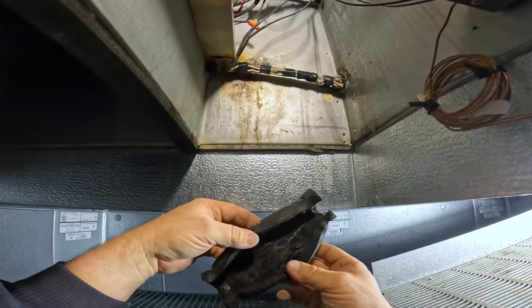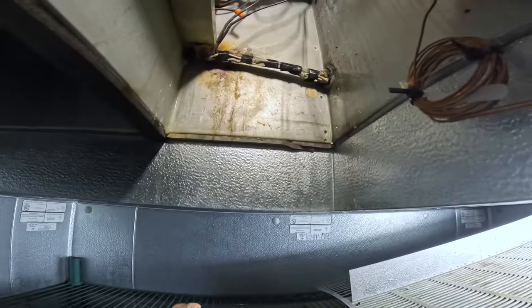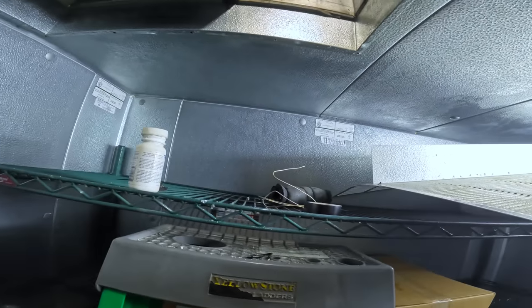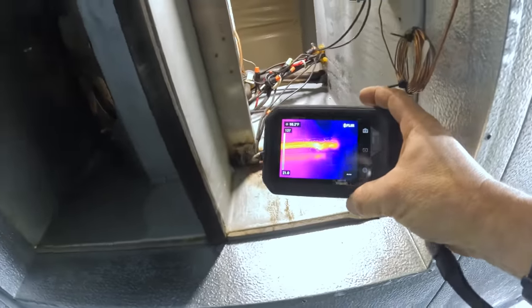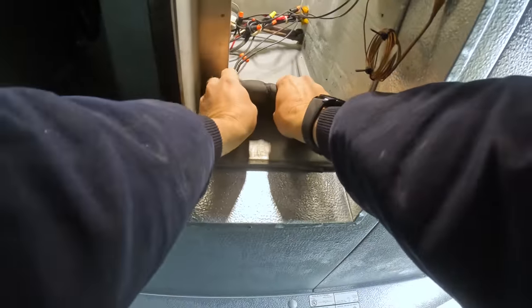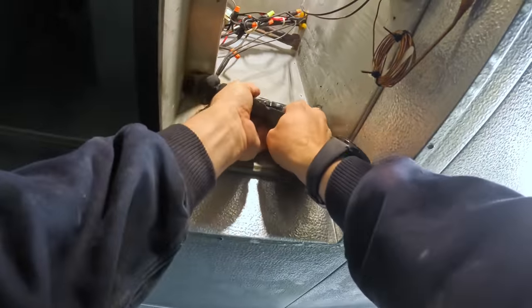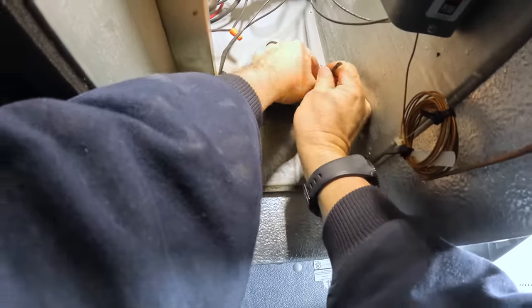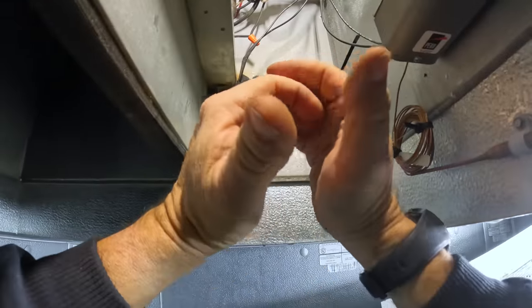I split the foam and just wrap it around it, then put wire ties on it. What I'm going to do is kick it on and make sure it gets hot before I button it up — I don't want to deal with that not working. That would be a total bite after you get done doing all that. It looks to me that it's working — nice and hot. What I did to get this on there was just roll it through the backside and then pull it over. There's just no easy way to do that otherwise. It's a little bit oversized, so I just rolled it and lapped it — made it that much thicker.